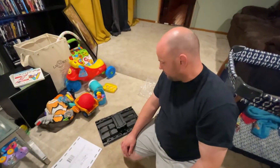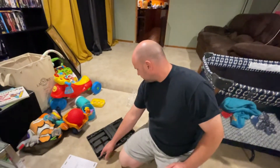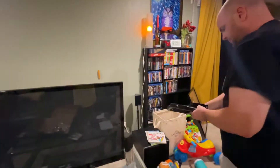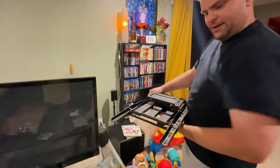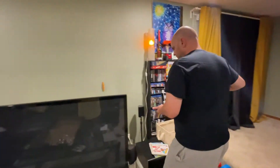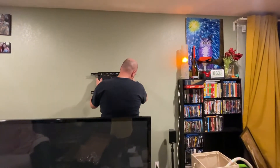What I need now is a level and my impact driver, set up to drive the lag bolts into the wall on these four spots. I want to make sure those four spots are where the studs are. Oh, voilà — I just learned something: you can adjust the width on this so you can get it wider if needed. Perfect. I'm sure this will definitely line up just fine.